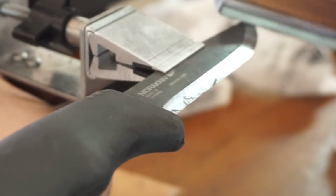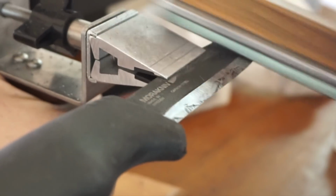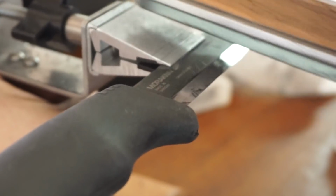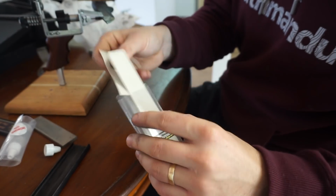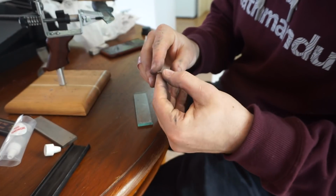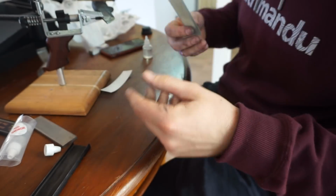You see these still do remove material, because even when you wipe the steel off the knife, like all the shavings, all the powder of steel, these start to develop a black slurry quickly enough, so that's more steel coming off and mixing with that oil. So these still do remove enough material to be properly de-scratching from the previous grits still. So I spent a bit of time on these and then moved on to the properly fine ones, from 3 micron down to 0.10 micron.